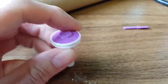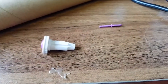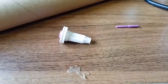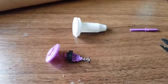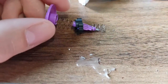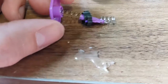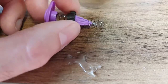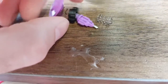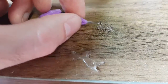I think we've got to take the end off to see what's inside this. I'm going to do this carefully because it's a spring-loaded blade that is designed to cut skin. That blade on there looks rather savage. You've basically got a spring here that you push — that compresses this spring — and that blade is held in by this cap. When you push it, you push it through the cap, the blade shoots out, that spring compresses and pushes it back again.